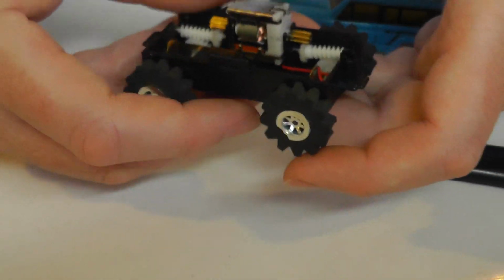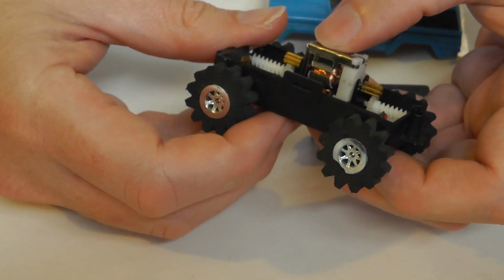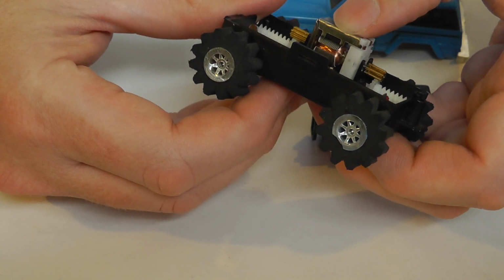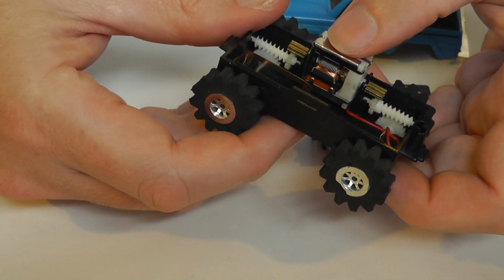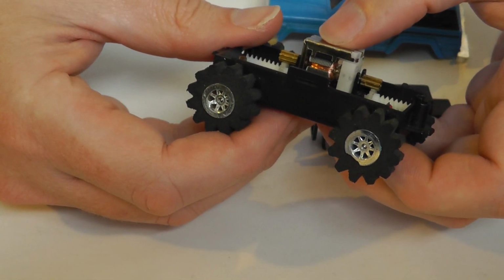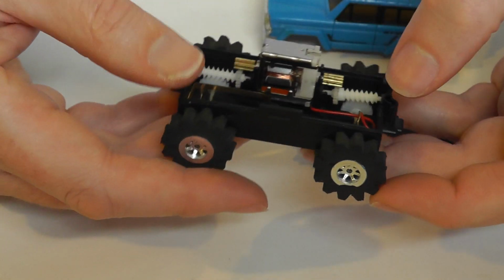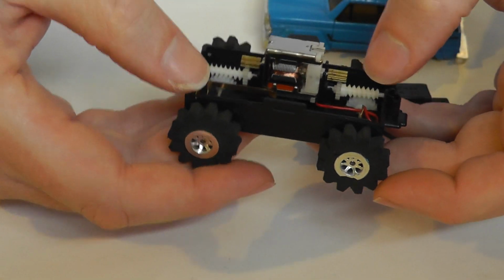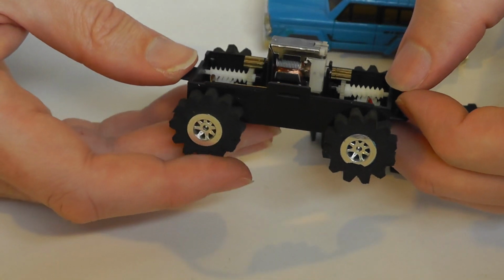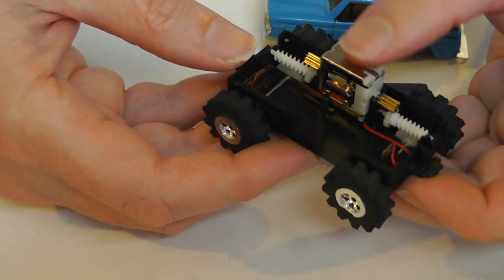Anyway, I used my multimeter and established that it was an internal problem on the motor. So I thought it's probably the brushes, the commutator, that was maybe a little bit tarnished or something. So I put some electrical contact cleaner on, and bingo, working properly. So quite happy to go from something that was advertised as untested, which probably should always translate as broken, to a working Trekker. So yeah, there's the insides.